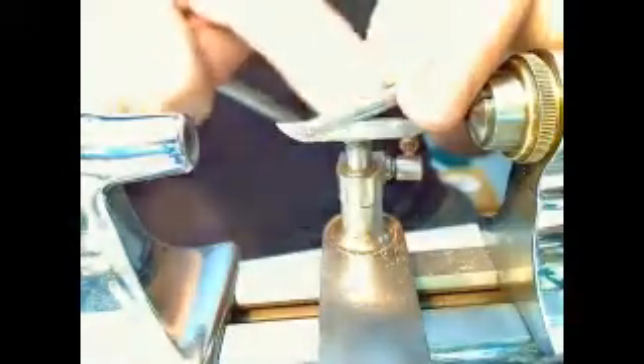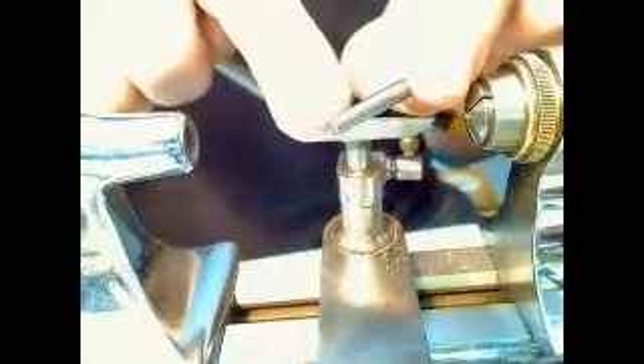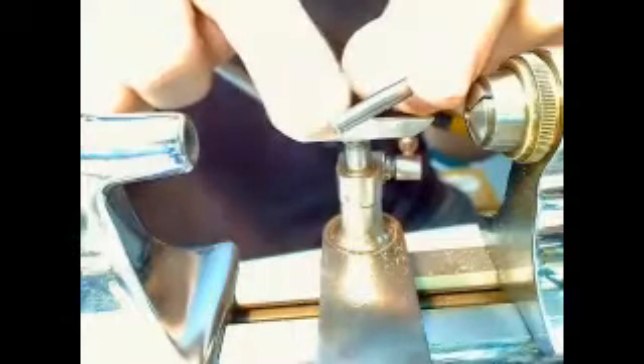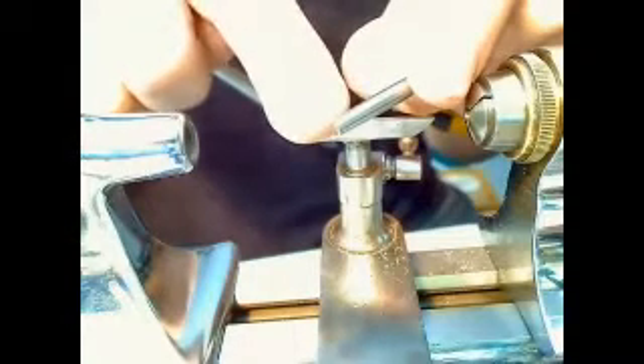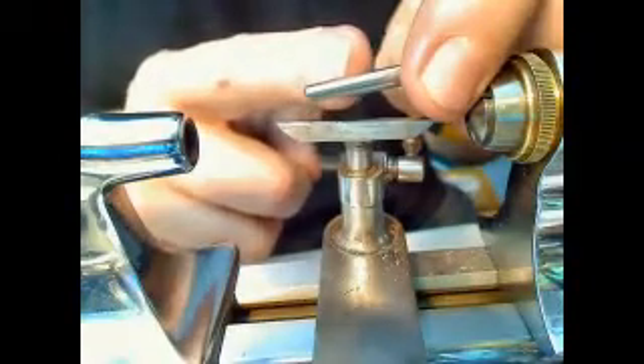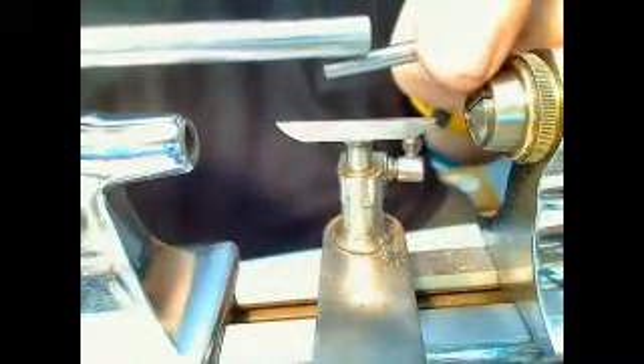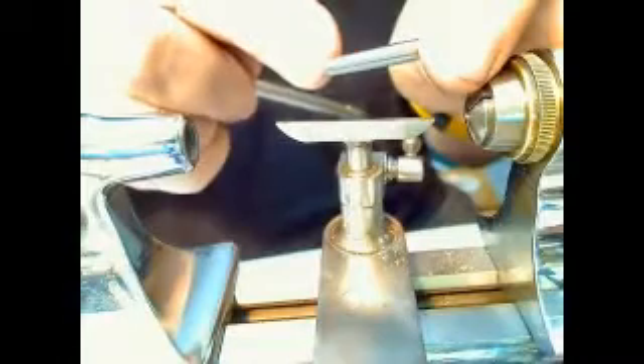You keep doing it and working your way up. So if there's a mark on the end here, once you've removed or graved that mark out and you can see the black being removed, you stick the tapered piece back into the spindle again, turn it, and you'll see the next mark will be up a little higher. You remove that and go all the way up again. Then you may only be part way through, and you'll see the mark start again at the bottom, and you work your way all the way up again until you've done it. Patience is a virtue.